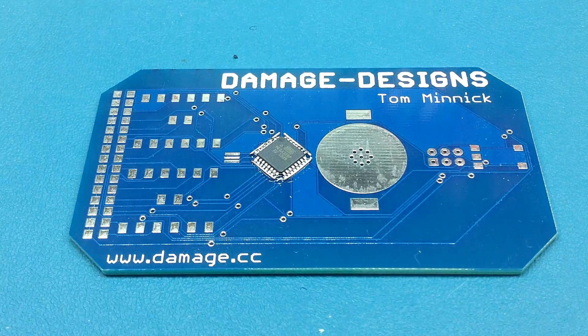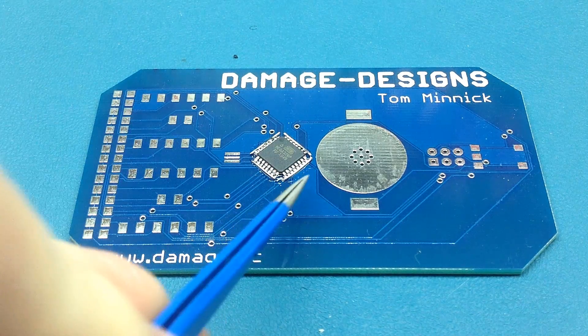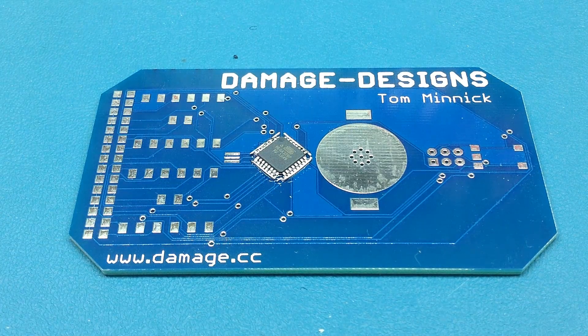Here's the interesting part — I may have a little bit too much solder on this side; it overextends the edge, so I may have to clean some of that up with wick. This is really just a first attempt, but let me warm up my hot air tool.